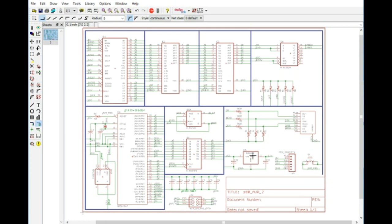I've got a couple regulators, but of course for prototyping I can use whatever for that. That's not really a big issue, and of course it would have this entire circuit here on the card itself with the exception of the resistors. Tactile switch isn't that big of a deal. That's easy, and we're not so much worried about this because we can just grab the RX and TX lines and power and VCC to power it. So I think this is going to work. Yeah, looks good. Okay, very happy.